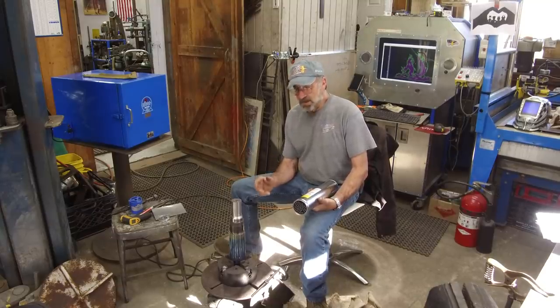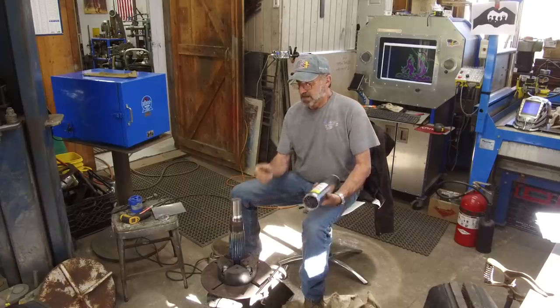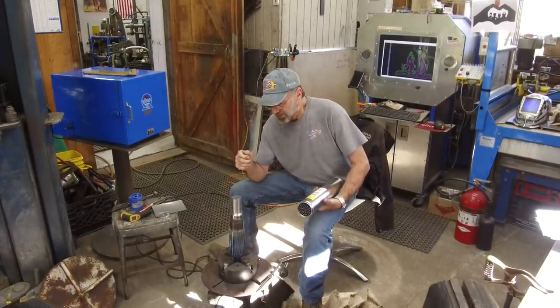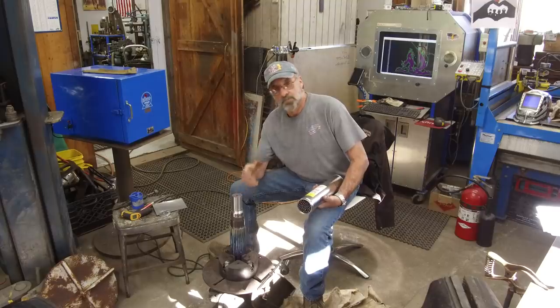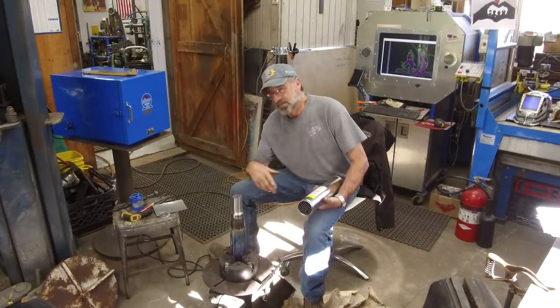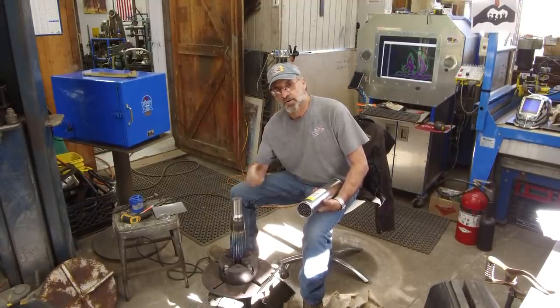I can control the rotation very nicely here. I can crank this and tilt it out a little bit. I can hold the stick and put my elbow on my knee right here. I should be able to give a nice uniform feed on that rod and make the optimum part. It's basically like building a drip castle, but you have to control it.